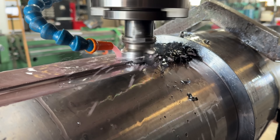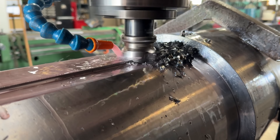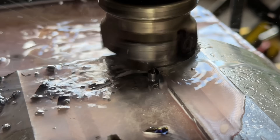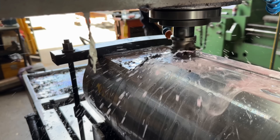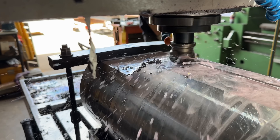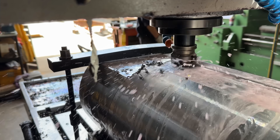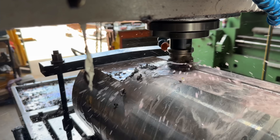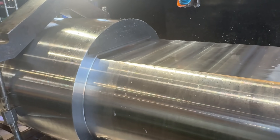I'm really happy with how that's come along. So this is an eight inch by eight inch — 200 mil by 200 mil — auger drive sub. It's got a box on one end that we cut last week, and we're just finishing off milling out the other two flats on it. We're going to use a 50 mil indexable drill — we call them a U-drill — to drill out the holes to 50 mil, and then a shop-made high speed steel tool to bring them out to exactly 70 mil. We're then going to test fit it, make up a pin to go inside of it, and then the auger is ready to drill. This is actually the first time we've used these indexable drills in our big mill, so we did play around with the feeds and speeds a little bit. We're aiming for about 400 RPM and a feed where it chips off nicely.